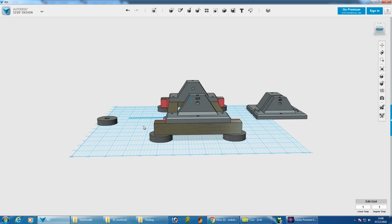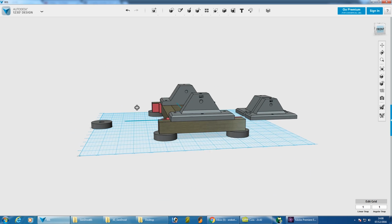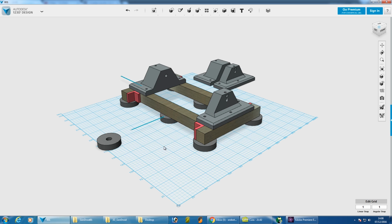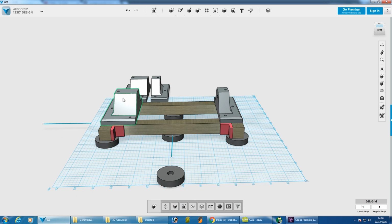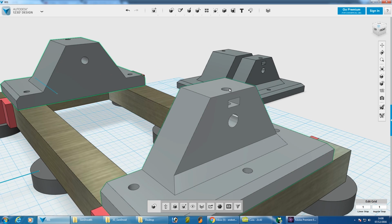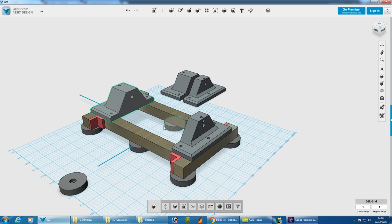So you'll notice I've got a rail here, of course there's a slot on it. So these things can be moved in and out to give it wider or narrower feet, or at least the contact points with the ground. They could also be changed in the future for pressure sensors or various different materials, but we'll print them in the HT for now. The main pivot sideways on the foot is going to be these. One is longer because it's at the toe end and the other one is at the heel end, and I've put a space in there for a captive nut so we can put a piece of 6mm stainless through and sort of screw that down at each end to hold it so it doesn't slip out.